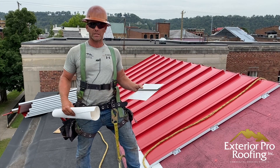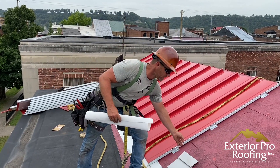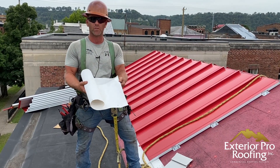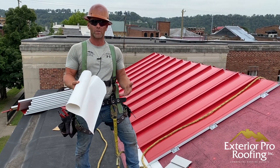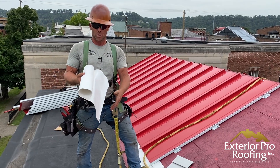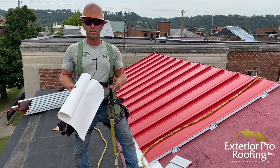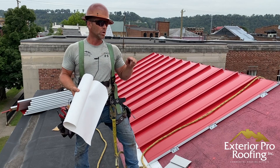What I've got in my hands is a piece of PVC liner — this is what we line box gutters with. It's a PVC roofing membrane, basically for commercial buildings, but we've applied it in an off-label use. It works great in these box gutters and we've done this for years to waterproof them.